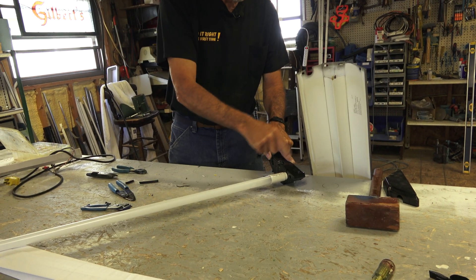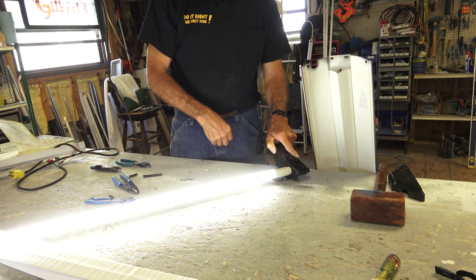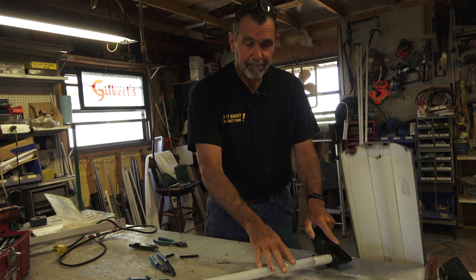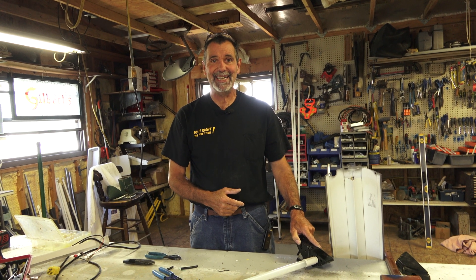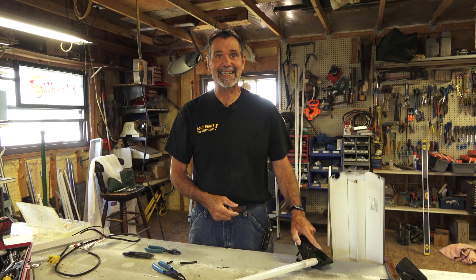Simple as that — 110 or 115 volts is going right to the bulb through the switch. When the switch is off, we break the black wire, so no power is going to the bulb and the light is off. If you can get your fixture apart and know what kind of bulbs you need to purchase, you can easily convert your old ballast-driven light fixture into a direct 115-volt LED replacement fixture. Quick easy tip from MrHardware.com.